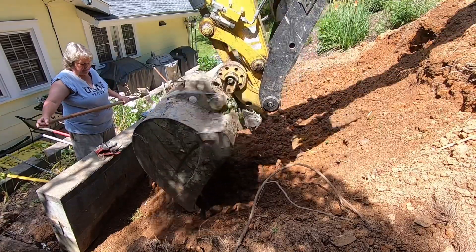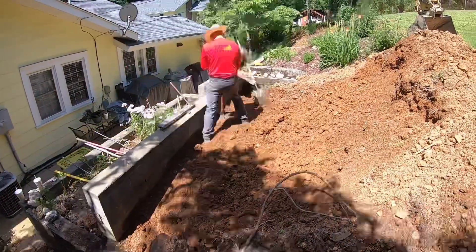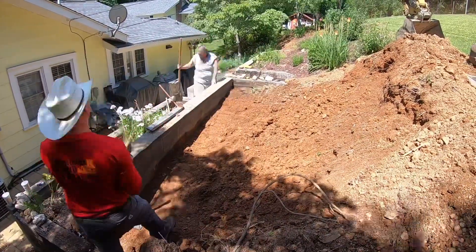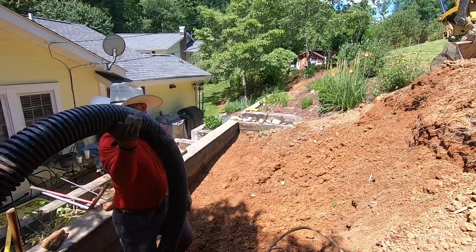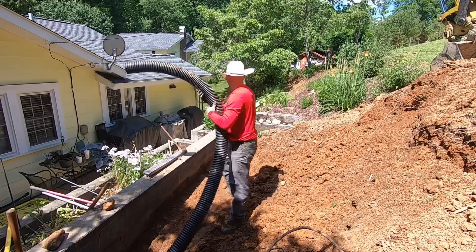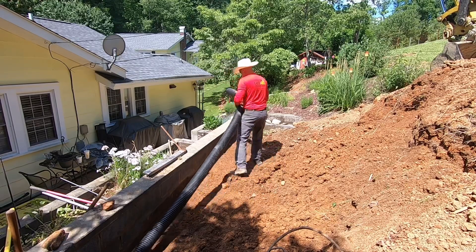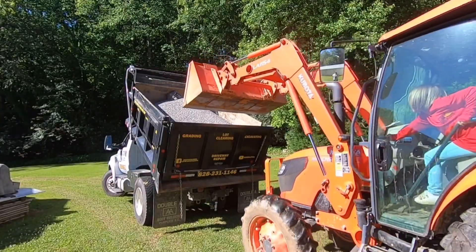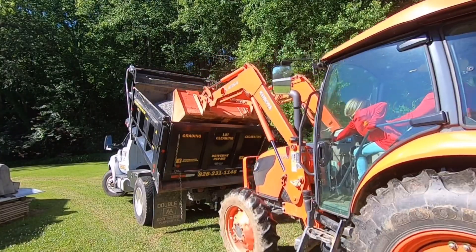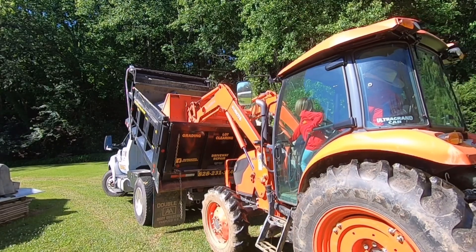In this part of the time lapse we've covered the bags of concrete up with dirt, and I'm tamping the dirt along the back of the wall, making a bed that angles back about six to eight inches away from the wall. In that trough is where I just laid the perforated pipe.